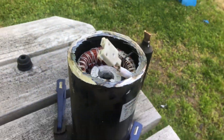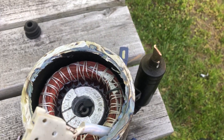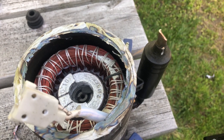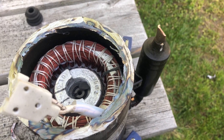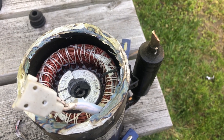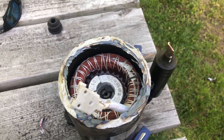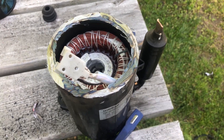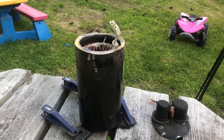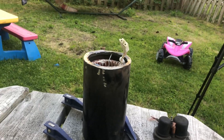which is actually kind of surprising when you see what I'm talking about. If you notice, that is the motor windings. They literally have the motor windings inside of the discharge gas, which is usually hot. Remember what comes out of a compressor - if you want to go back and review that video, it's just a couple videos back - what comes out of a compressor is hot, superheated gas.